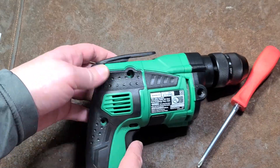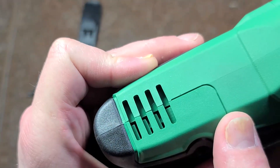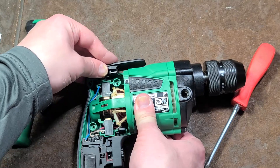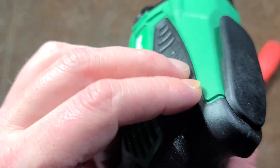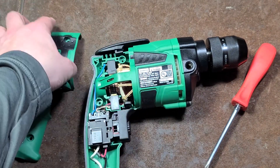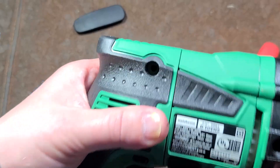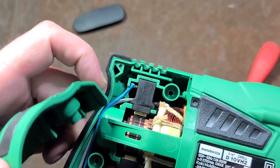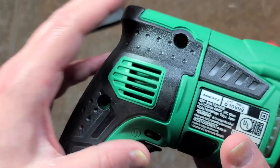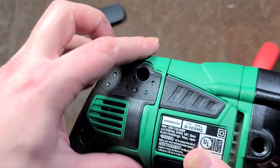Interesting observation: the way this top belt clip plugs in, it's actually a vent right there for additional airflow. But when they put in this belt clip, it's designed to fit into one of these convolutions here, and when you have that in there, it blocks the top vent. That's a little bit of an oversight — they should have had some notches there. But if you have one of these that's overheating and you don't use the belt clip, you can just pop that thing out and all of a sudden you'll have a whole bunch more airflow. The belt clip is also blocking a lot of air from getting over the upper brush. The way these vents are offset below the center line of the motor means the lower brush is already getting more air than the upper brush from the side vents, so it really kind of needs that upper vent. I'm going to leave the belt clip off of this.